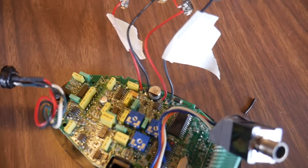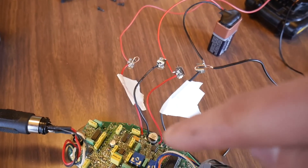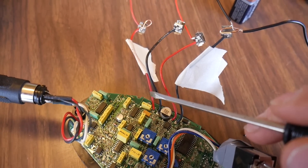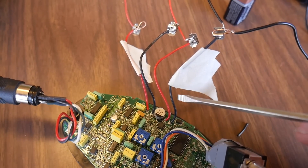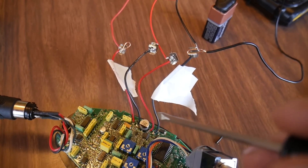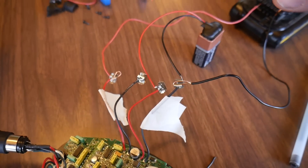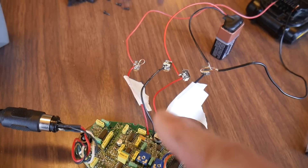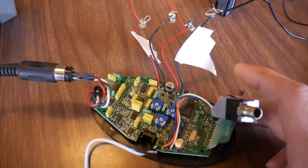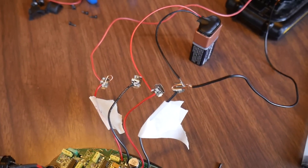After doing some testing, the batteries are wired in series so you get 18 volts. This outside red wire is the positive, this one's the negative — that's the 18 volts, and we don't have to connect this one. So just 9 volts going into here and then connecting to the ground, the negative here. We essentially have two circuits going on: an 18 volt, a 9 volt, and a common ground. And it looks like it's fully functional. The screen is on and I did check it and everything's working. And it works. Perfect.